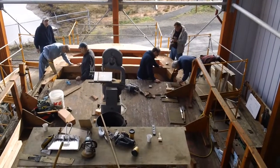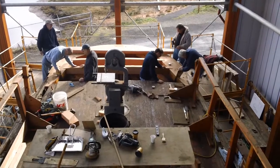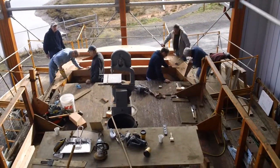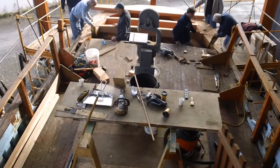Yeah, 1/2 inch through the existing material, the beam, 3/8 into the. I was thinking, John, once you're set up, get some blue tape and tape off the drill bits so they're all the same. Take some blue tape and mark the thing so we know.